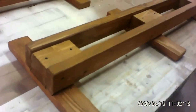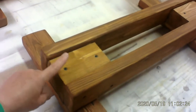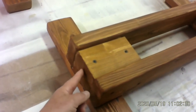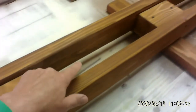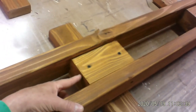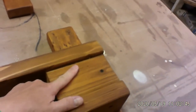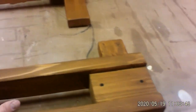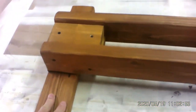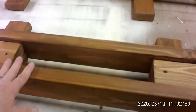I've built two of them, one for each side where the ratchets are, and this is how it's put together. This is all 2x4s — a 4-foot 2x4 here. These are 6 inches deep, and I've got two of them together, glued with Gorilla Glue, then put screws in them. Same thing here — 6 inches deep, two pieces of 2x4 put together, Gorilla Glued, then drywall screws, same thing with this piece here. These are 4 feet long, and these are 18 inches long. I put them one on both ends and one directly in the center.